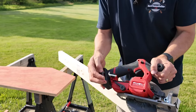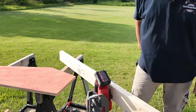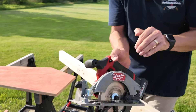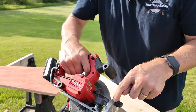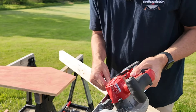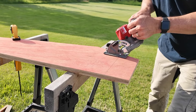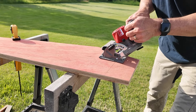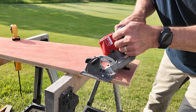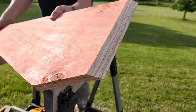It's good to see the rafter hook right there — it just goes over a 2x4 just like that, and then neatly folds out of the way. I like the way that it curves, giving you easy access for the depth adjustment. Everything on here is very easy to read. Let's try doing some bevel cuts — to adjust that it's very easy. As I mentioned, it goes up to 50 degrees. Let's do a 45. Yeah, that looks straight. I'd say that looks pretty good.